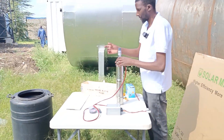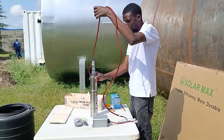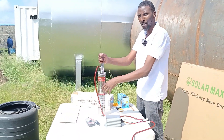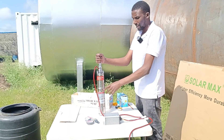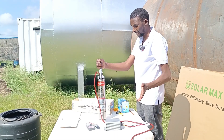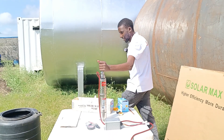This will act as my reservoir and then I'm going to return the water back. Since I'm not supposed to do any demo with this particular kind of pump without running it in water — remember this pump is supposed to be cooled by the water that it is pumping, so you are never supposed to let it run dry.